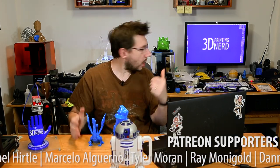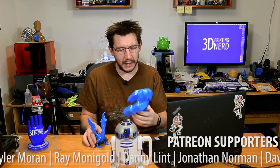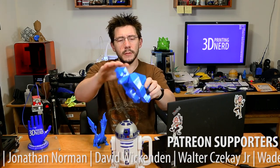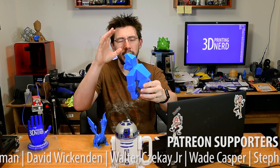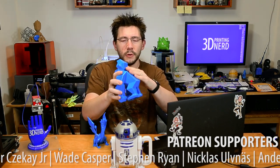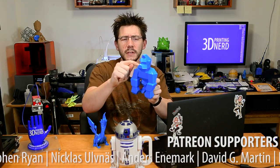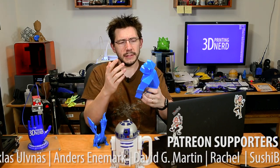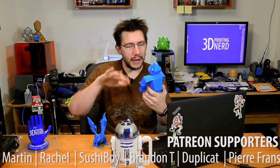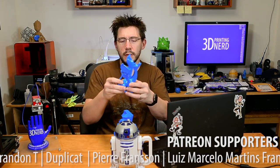I still have the polisher right behind me, and I've been trying to polish some models as I've printed them. This is the low-poly Donkey Kong from Flowlistic — I think he's got these up on Pinshape. The smoothing action of the polisher really does a great job on some things. I'm getting some weird Z ribbing and I need to get to the bottom of that — it could be how the printer printed something, or how the layers were laid down, or the angle. So I'm still doing some investigation there.